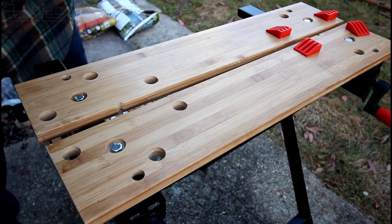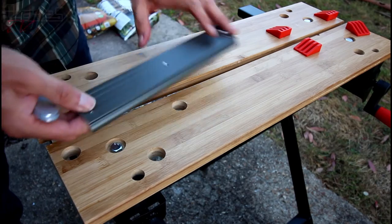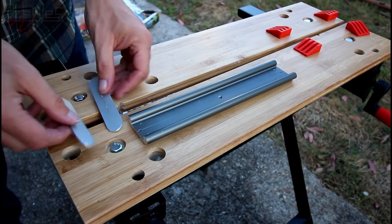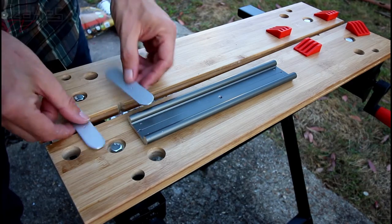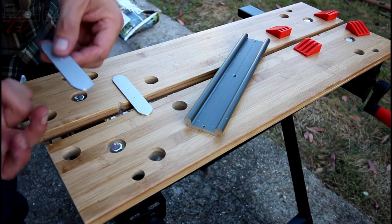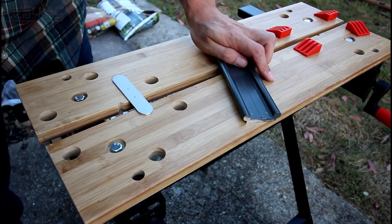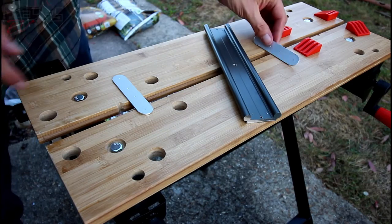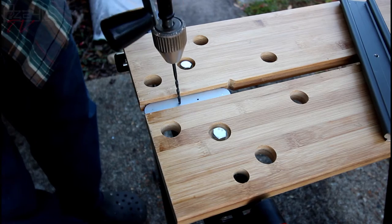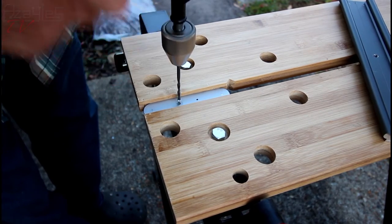While my camera was recharging, because the battery was getting a bit low, I've drilled these out and drilled that out there. I've drilled the feet struts out, so these will go this way up. That'll go on top. I'm going to screw through underneath and I'm going to tap that. Wish me luck. Not the same tap, this is going to be an M3 tap. And here we go. This should go nice and easily.